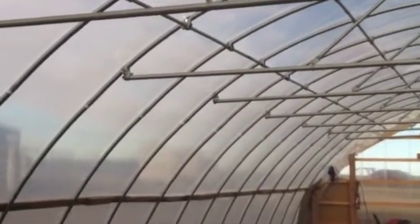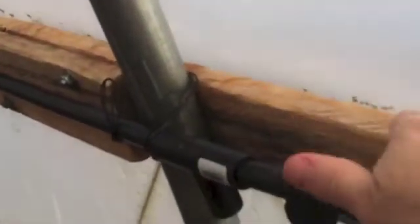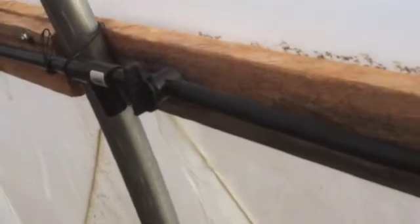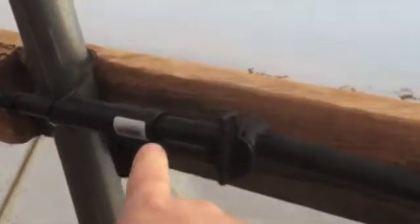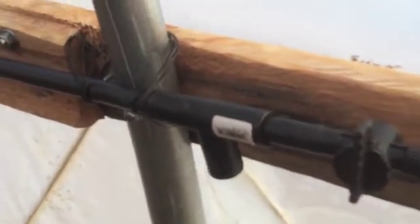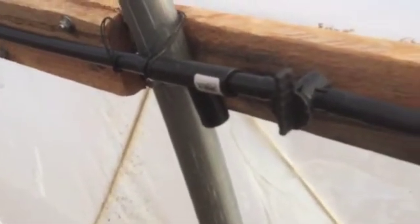Let me get a little closer over here to the ribbon board. The half-inch poly tubing runs along the ribbon board, and here is a flush spot — we'll put a piece of tubing here and fold it off to make a seal so it's not running out, but we'll be able to open it up to flush the lines.